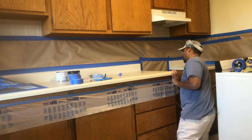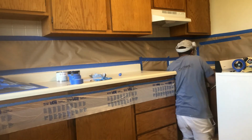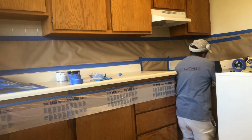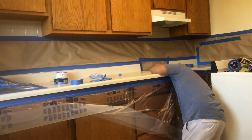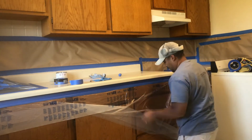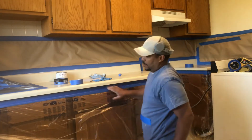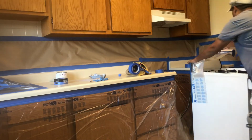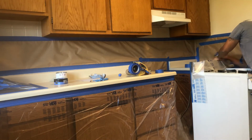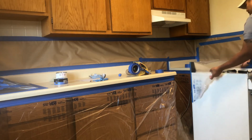And after that, it's my second best friend. It's the 3M plastic with tape. This is another item that's kind of pricey, but well worth it, because I could always make that money back, but I can't make the time. And this is a time saver. Just like the paper masking machine is also a time saver. You just run it across the bottom of the countertop and you pull the plastic. I think it's about 4 feet, 48 inches, and it covers the kitchen counters.